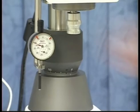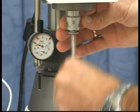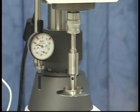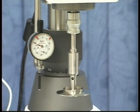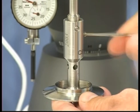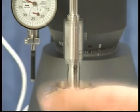Insert the cone by pushing the coupling sleeve up. Insert the cone in the coupling and push the sleeve down until the measuring element is held tight by the coupling. Loosen the hexagon screw on the measuring system to allow the cone and cone shaft to move freely.